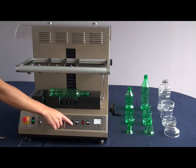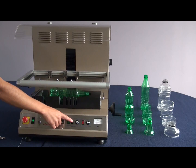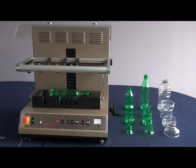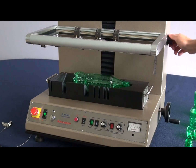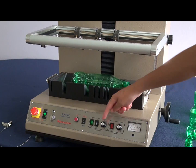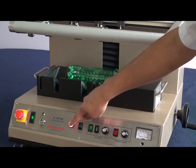The carriage may be operated in the semi-automatic mode to determine the optimum speed and temperature for a given type of bottle. To prepare for fully automatic operation, the operator sets the sensor height, which tells the machine when to slow down and to heat the cutting wires. The operator also sets the proper heat and speed for the cutting carriage.